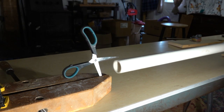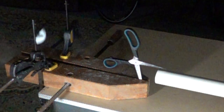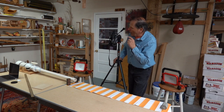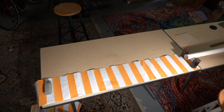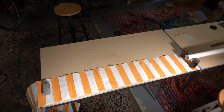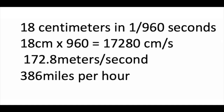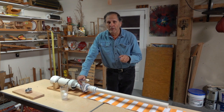Let's try a shot against a sharp edge. As expected, it cut it in two, but it's too fast to catch clearly with my camera. Now to figure out how fast these balls are moving, I've painted this one black and I'm going to fire it across the top of this speed strip while this camera is recording its motion at 960 frames per second. If we do a little bit of math, we should be able to calculate its speed. Even at 960 frames per second, the ball is still a blur, but we can roughly make out that it's traveling about 18 centimeters in that time period, which works out to about 386 miles per hour. With an exit velocity of almost 400 miles an hour, that's pretty fast, but this is still about 200 miles an hour slower than the vacuum cannon.